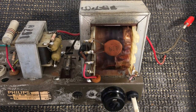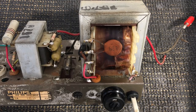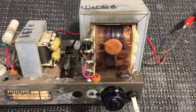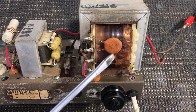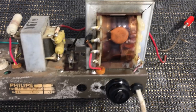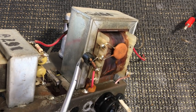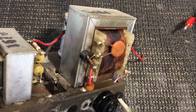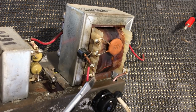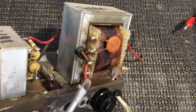What you'll notice is there's quite a bit of charring — this thing has seen quite a bit of heat. We know it's working because we heard the noise, but it's been through the wars. My guess is that some part of the circuit was drawing too much current. There's that safety cap — I'm going to leave those in. There's a bridge rectifier — a very small component — taking the AC output on both sides with ground and a positive output.